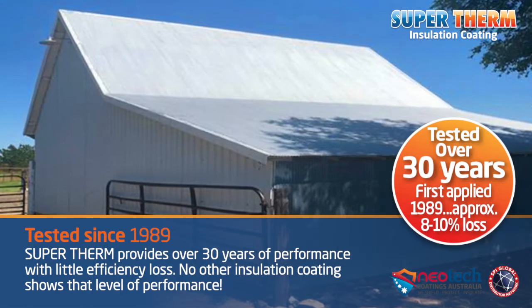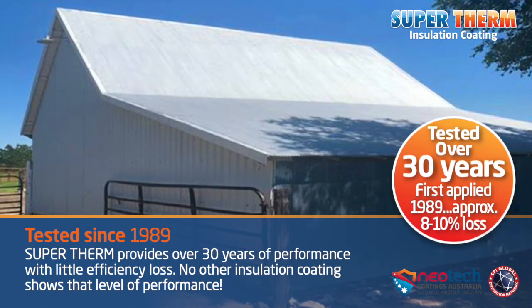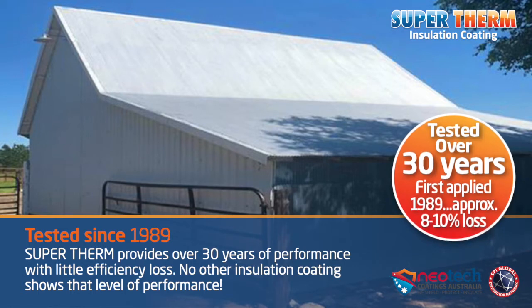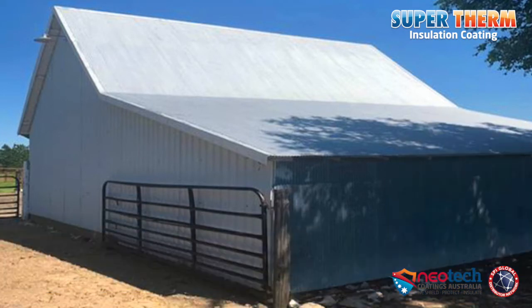That's why when it gets dirty, like after 18 years on a test roof that the Japanese have been testing in western Kansas, after 18 years we only lost 8% of the effectiveness of it, because of the emissivity part. It's dirty. It may not be able to reflect like it did in the beginning, but it still does not load heat. And that's why it continues to work. Not because of reflectivity, because of emissivity.